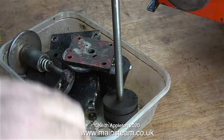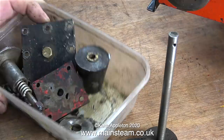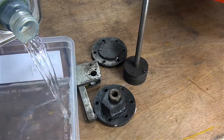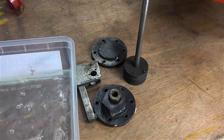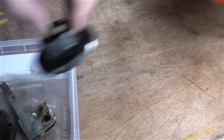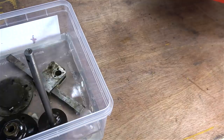One of the problems with a job like this where you get an engine in bits is you have to put it back together before you can test it to see how much of it doesn't work. I've removed the cylinder covers, the piston, the crosshead and the guide. I'm going to put all of these into a tub of cellulose thinners — also known as lacquer thinner in the USA — to degrease and clean them so I can see how well they're made and how well they fit together. Tomorrow when I come back, the dirt on these parts should be easily removed with a paintbrush.